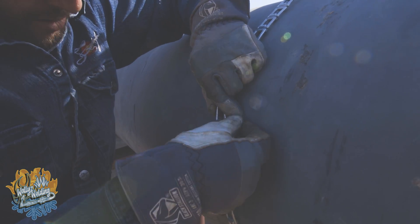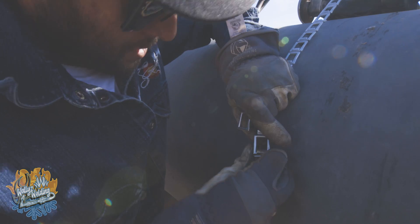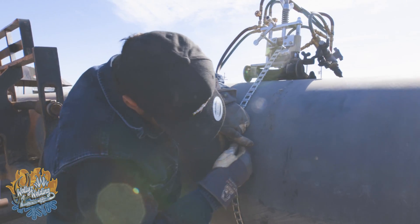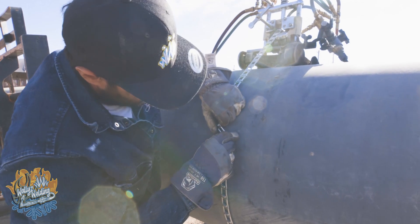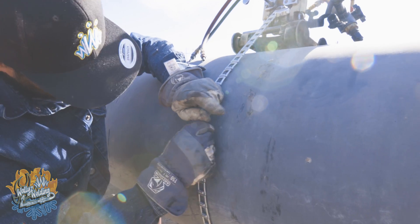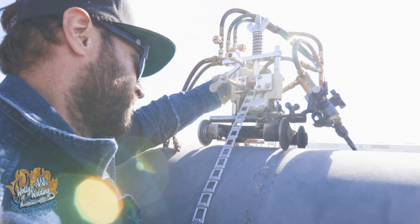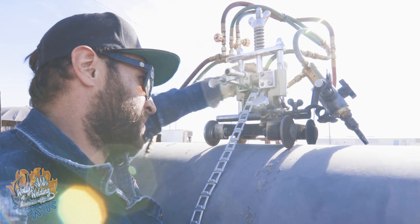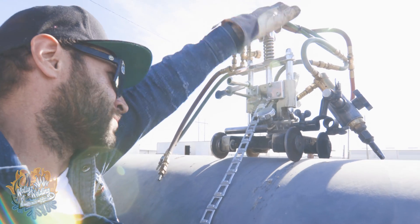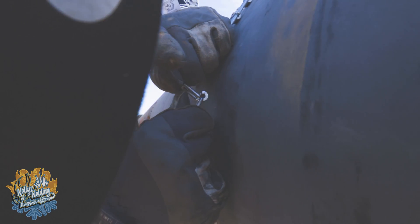Now these do go on one way or the other. It's got a flat side on one side and that's the side that's supposed to slide through first. It's getting heavy over there. Might have to get some more slack going here. This is the easier job with two people. I always like to do this with two people because you can have somebody just hold this machine for you over here, and then you don't have to fight getting this chain on. Because I got a lot of strength here in my back arm to hold the beveler from flying backwards.